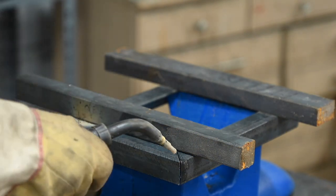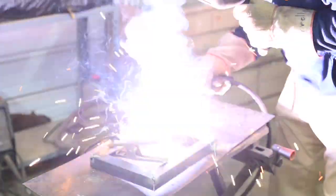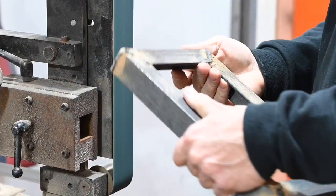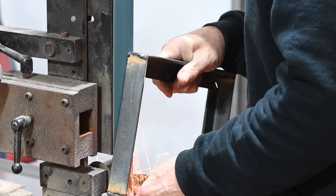As with a great many things in the metalworking world, three quarters of the work is in setting up and fixturing everything, and the welding itself only takes a few minutes. I'm just using a flux core MIG welder with no argon or anything, so the welds are super ugly, but they'll hold up perfectly well for this build.